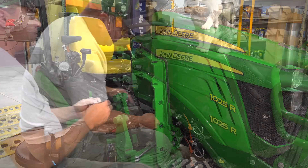Now we're going to remove these four hoses from the loader, disconnecting them right here at the hard lines and replacing them with shorter hoses. The two additional hoses for the third function will be separate. It's a good time to have some shop towels around because these leak as you loosen them. I made the mistake of thinking shop towels would be enough here, but they are not — I loosened this yellow line and oil just poured out of it.